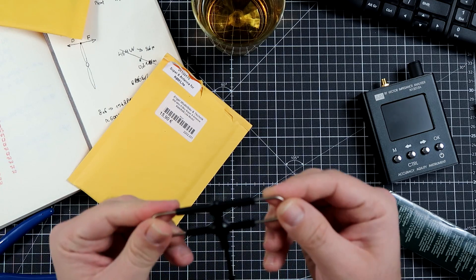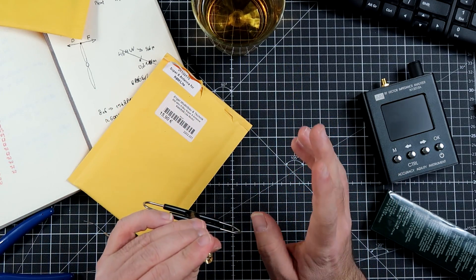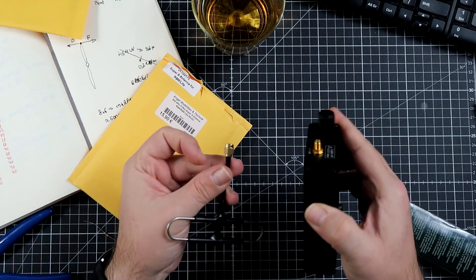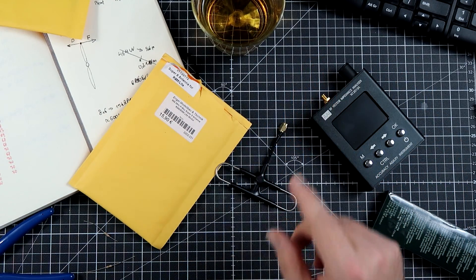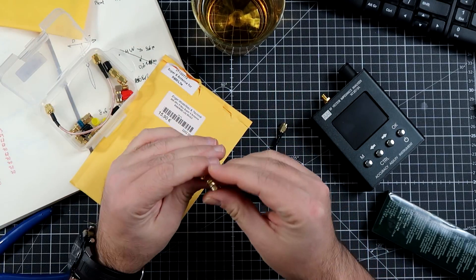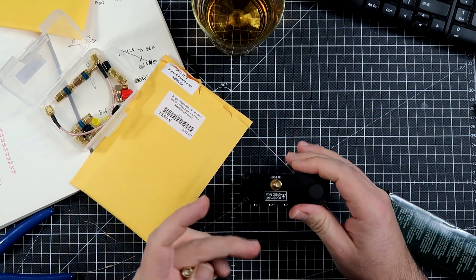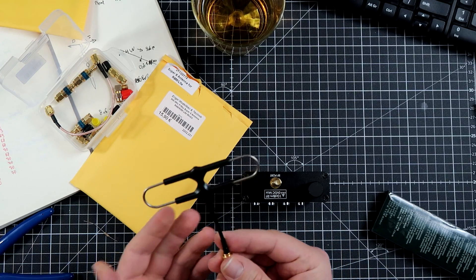The wire over here is really thick, which also suggests it's relatively wide-tuned. Over here we have RPSMA, and here I have SMA. I need to get the adapter. Let me connect the adapter and see if this antenna is really tuned for 868 MHz.